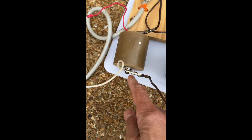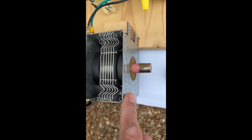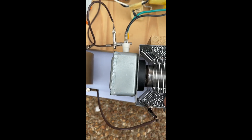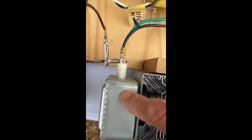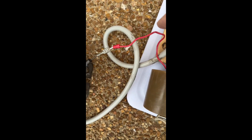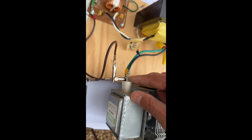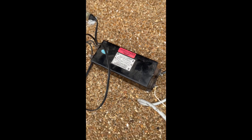The positive DC that stores up in this capacitor goes to the casing of the magnetron — and if you haven't seen a magnetron, this is what they look like. This one has the filament and cathode in this box. So the positive is here and then the negative of the capacitor goes to the cathode which is here, and I have three volts AC across the cathode which is a heated filament, being heated via this transformer. The Variac that controls the neon sign transformer is also inside the garage.